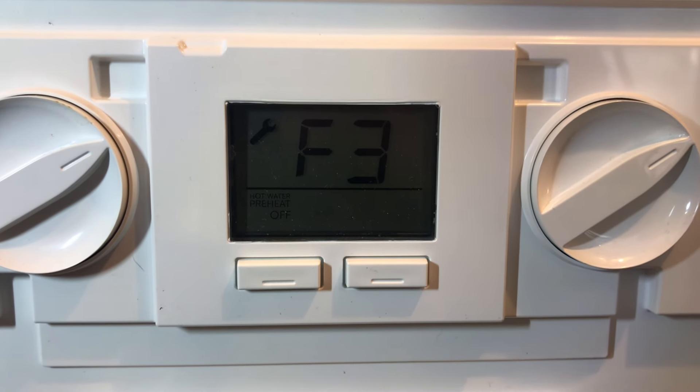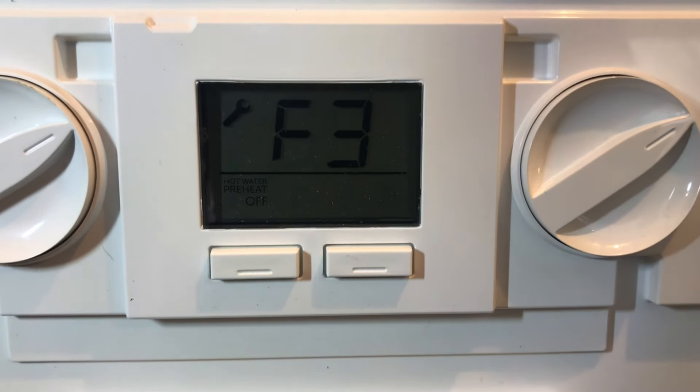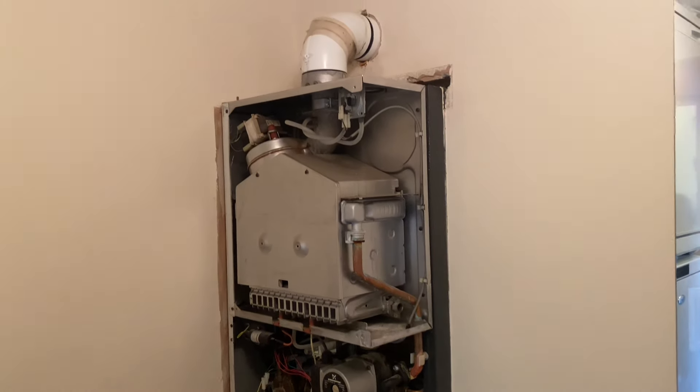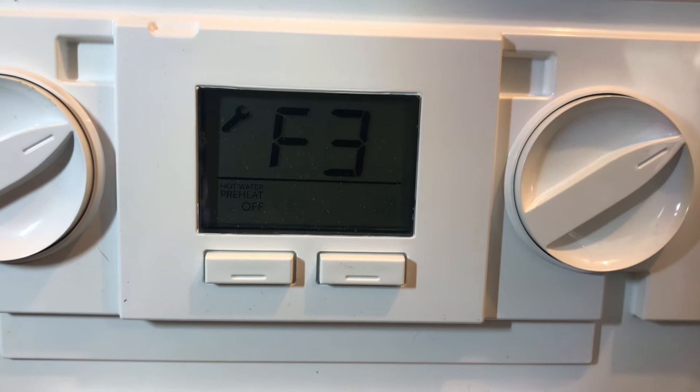Specifically a condensing boiler fan. There are two types of fans on a boiler. The first type is the non-condensing boiler — the standard efficiency boiler with an atmospheric burner. The fan is on the negative side of the heat exchanger, after it — essentially an exhaust fan that removes the products of combustion. It has a 240-volt supply and a coil with a readable resistance. These fans are straightforward to test; the usual problem is dry bearings due to the heat.